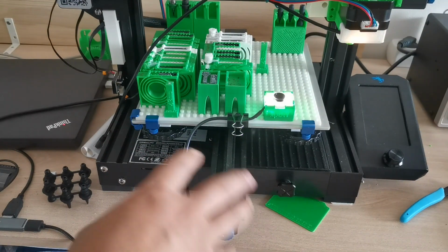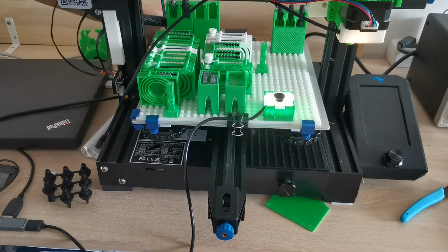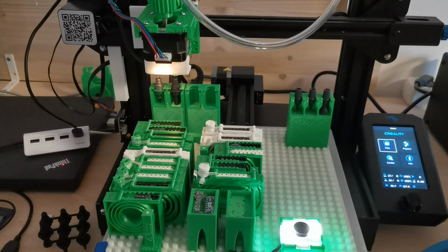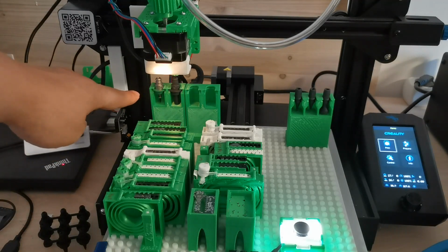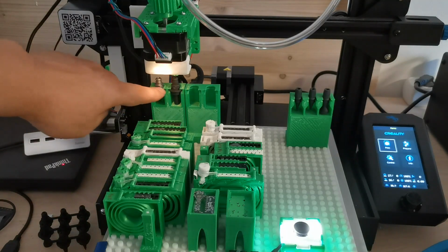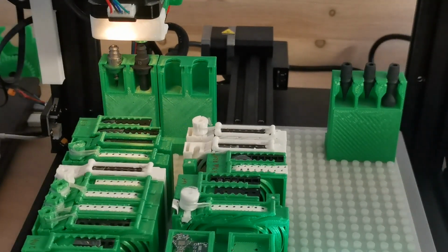Now, what I need to do is start the machine and then calibrate the device. Okay, so now I have already calibrated the machine: the home fiducial camera, top camera, bottom camera, and now I also calibrate the position of the nozzle tips. I put one of the Juki nozzle head and nozzle tip, and the other one is the printed one. So now it's working well, so I can mount the nozzle tip.